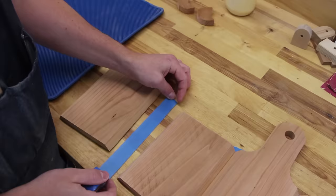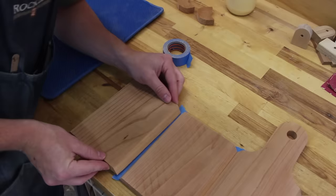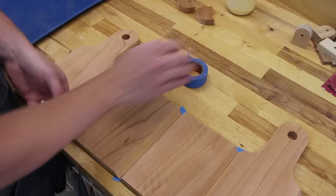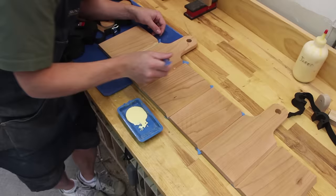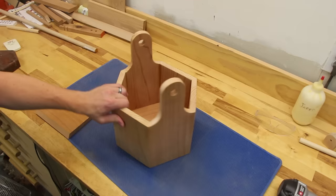Blue tape can also be a great clamp, especially if you're doing miters or something that returns and connects to itself. The way this works is you lay the tape under each joint, then take your miters and put them almost exactly touching on the tape. Continue laying out the tape and putting the boards together so they're just barely touching. Once all pieces are connected, bend them around, do a dry fit and make sure you don't have any gaps. If all joints look good, open it back up, put glue on each one, roll it back up, close it, put glue and tape on that last joint to complete the circle and you're good to go.